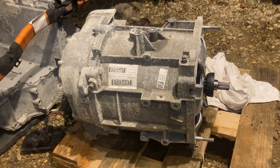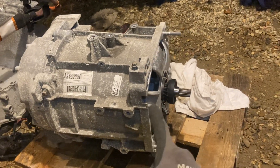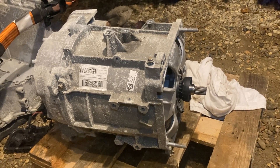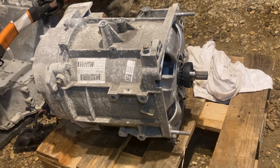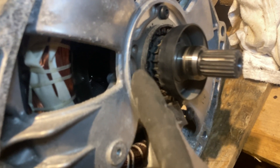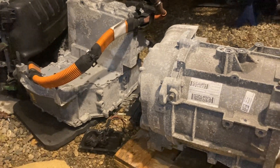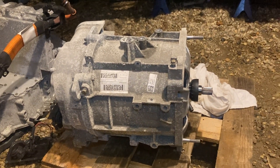The next job is obviously to get this apart and fit the bearings. Strip it down and make sure we're still happy with everything once it's apart. We know this has broken down with a sensor issue, but I think because the bearings are just quite bad, it's likely bearing movement and bearing heat causing that position error. There is quite a bit of corrosion on that ring — we'll definitely need to replace that inner ring, swap the brushes given the wear, and check that sensor. So yeah, it's definitely going to need work, but it's good news — we're actually getting somewhere. All right, catch you later.